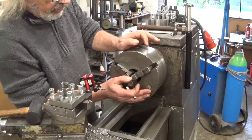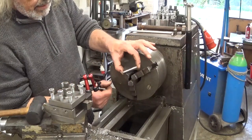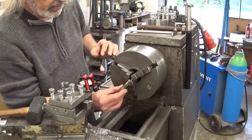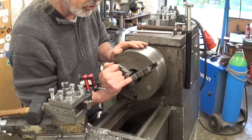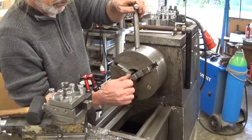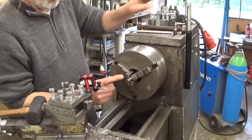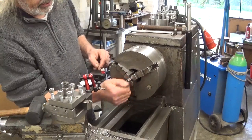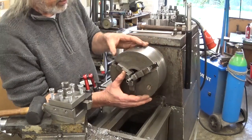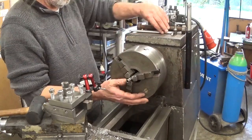To center the chuck, I have a nice little trick that I suppose you already know, but in case you don't. I use a piece of a lawnmower — this is the pin that goes to the piston — and I put it in here. Make sure there's no chips and other chunks in here. And then tighten the thing not too much, not to deform it. This is a very nice and precise ground little part. And the rim that holds the chuck in place on the back plate, I cut it a little bit smaller, so now I have play.